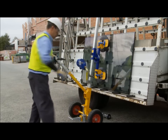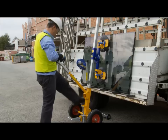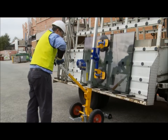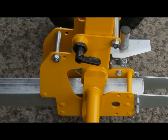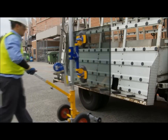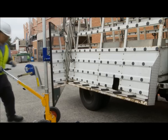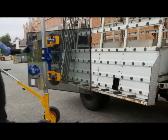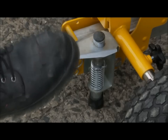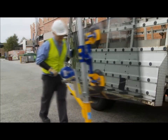Start winding up the winch to tension the cable so the glass can be unloaded. Release the black lever so that when the mast is tilted back, this pin will lock the mast vertically. Once the mast is locked vertically, the Express with glass can be moved. If the glass needs to be re-orientated, then brake the Express and move the glass as required. In this example, the glass is swiveled to the side to allow the operator to move the glass through a narrow passage. This is achieved by placing one hand on the edge of the glass and unlocking the mast pin.